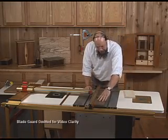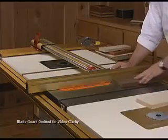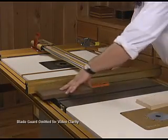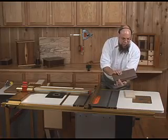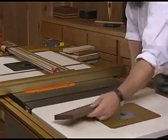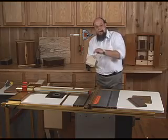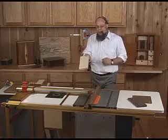The first step is fairly straightforward. We need a couple of slots to inlay into right down the side of the board. We'll cut those slots to an eighth of an inch on the first pass — that's the kerf for the blade we're using — and in a second pass, widen the other slot out to exactly three-sixteenths. Where things get more challenging is not the slots but ripping those little tiny parts and getting a perfect fit into those slots — not too loose, not too tight.